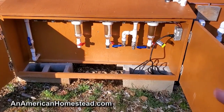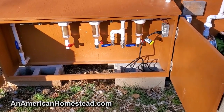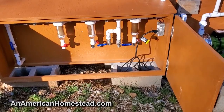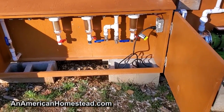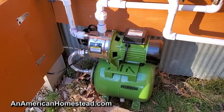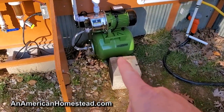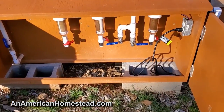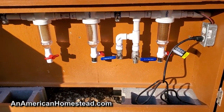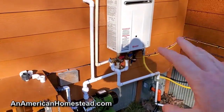One of the first things we've been able to do is upgrade our water system. We had a different system in here — an RV pump that was supplying pressure to our house — but that RV pump is just not meant for day-to-day, hour-by-hour use. I went ahead and removed that and put this system in here. This is a Harbor Freight system that connects basically the same way: you have an intake, an outtake, and it pressurizes the system. It provides more pressure, more consistent pressure, has a more powerful accumulator tank, and I still have my spin-down filters for pre-filtering the water before it gets into our system.